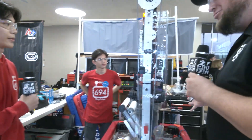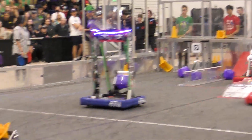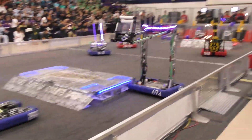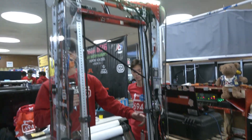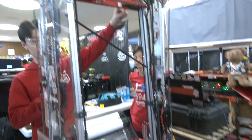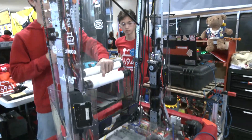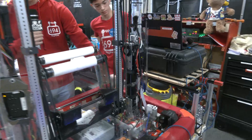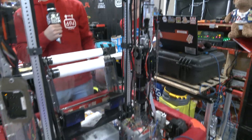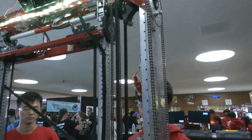How about this arm? This whole structure is really impressive. When we made the arm, we really wanted our center of gravity to be low and in the center of the robot. So if you look at the motors for the arm, they're all the way in the middle of the robot near the bottom. The only thing on the arm are these motors that control the intake rollers. This motor controls the wrist — you'll see the pulley here turns. These two at the bottom move the arm. To move the wrist, we have dead axle pulleys connected to chain. We actually call this a pulley sandwich, and it runs from here all the way down to the wrist.